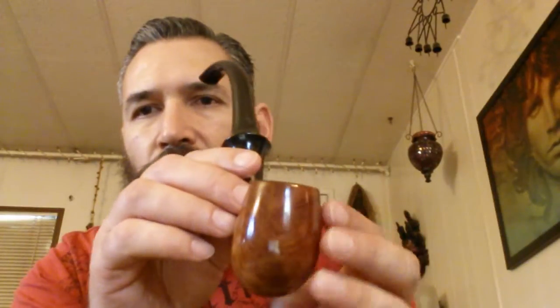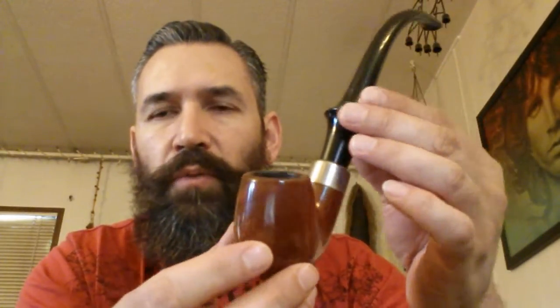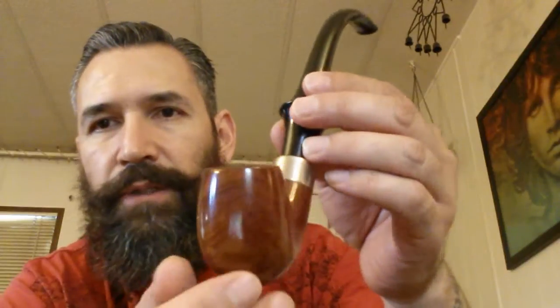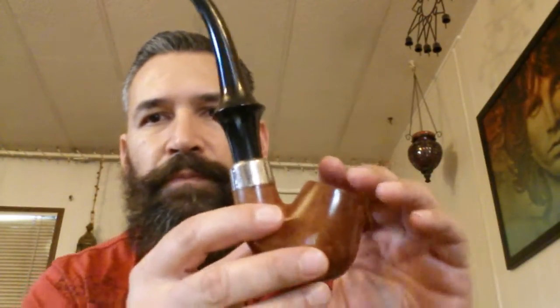What I did was I started sanding it down just to see how bad it was, and as I sanded it turned out there was no burnout — it didn't go right through the grain or anything. So I sanded it completely. I don't have any dye and wouldn't know how to use it anyway, so I just cleaned it and buffed out the original stain that was still there. The finish was gone but some of the stain and the natural wood coloring remained. I buffed that out with Tripoli, and on this one I did do a little bit of waxing just to bring it out a little more.